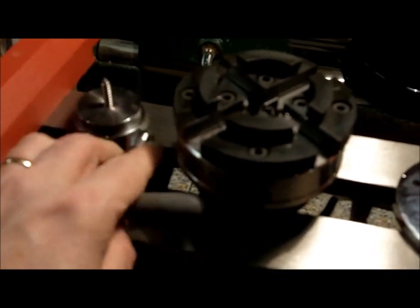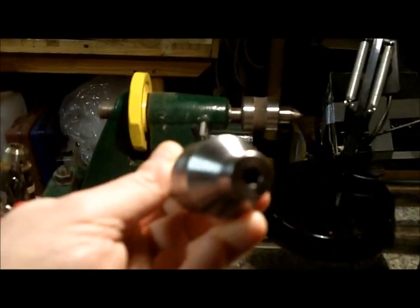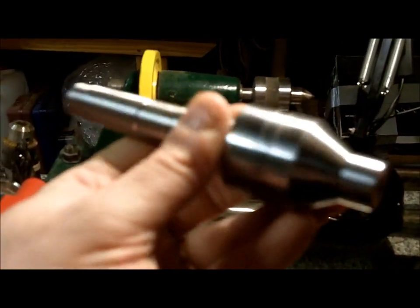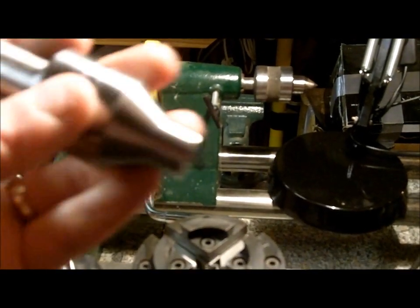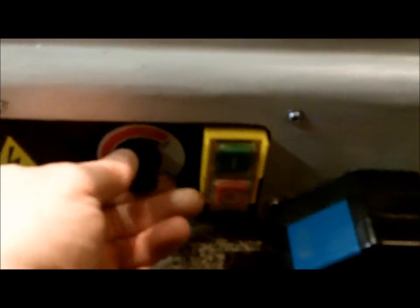I've purchased a worm screw for the chuck. It came supplied with a 75mm faceplate and a chuck key. I've also purchased the Axminster Mandrel Saver for pen turning — Bob at RJB Woodturning and Mike Walt have mentioned these. Instead of compressing the mandrel itself and potentially bowing it, this applies pressure just to the bushings and blanks and transfers that pressure to the headstock, keeping your mandrel safe. I've also bought a number two Morse taper pen mandrel, so I'm all good to go with pens.